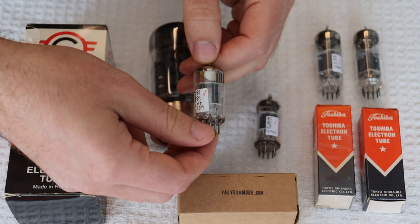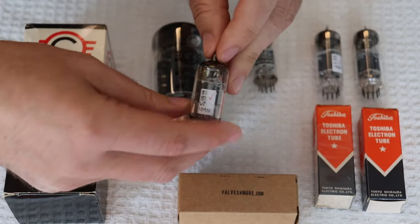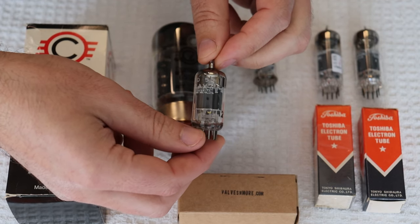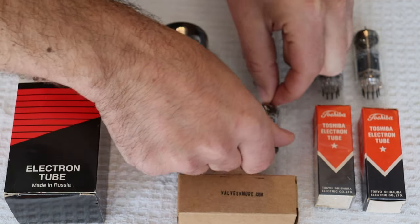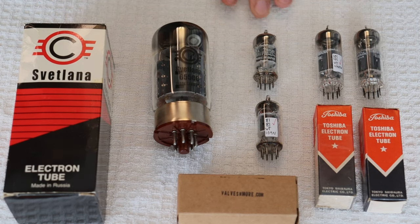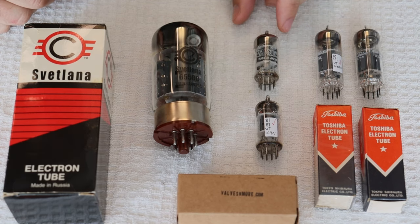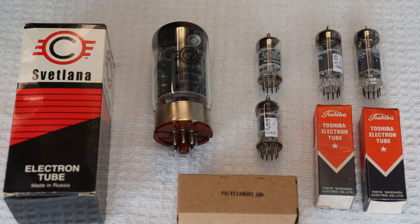Almost all of the goodness of the Mullard 12AX7, with the quality manufacturing of Matsushita, which of course is a Japanese company, and as far as I know, they made all of their tubes in Japan. And we almost never have a problem with Microphonics or noise. They're great. We managed to get in some more, used more than new, but we have some new old stock. We have some used stock that is testing fantastic, and we've got some matched pairs of those in the store. And as usual with these high gain tubes, we also have a section for ones that are mismatched for all you guitar players out there. These are great options to replace noisy or bad 12AX7s in those amps.